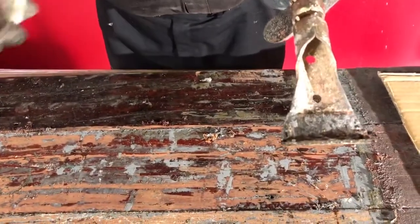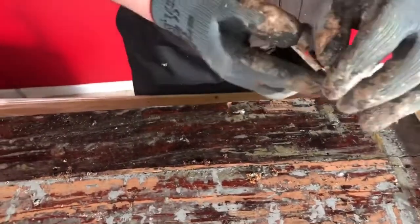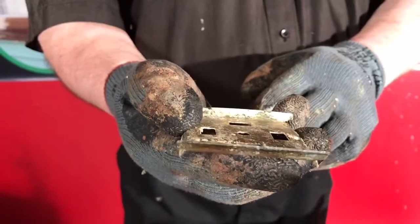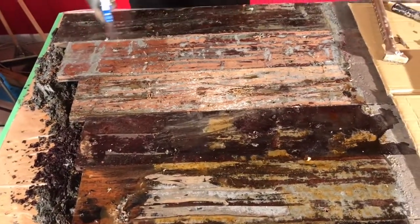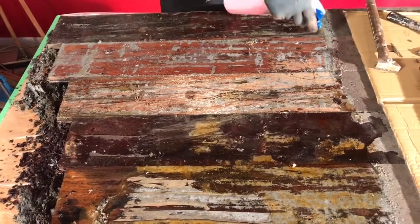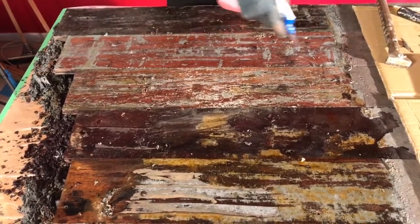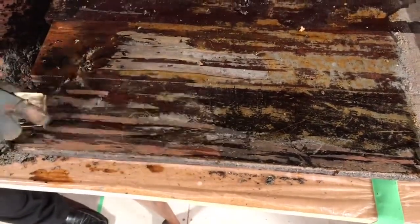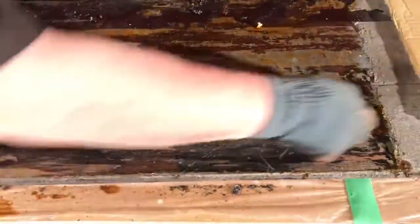This blade here, they've got good and bad points. One is they're very sharp and they're good at that first part I did, but they do have very sharp corners that can dig in. And so this four edge blade we have, you'll notice hopefully there's a curved edge, and that gives us more control over the scraping without digging in. So the curved edge means that we can move the goo without gouging into the timber. Sort of slices over the top.